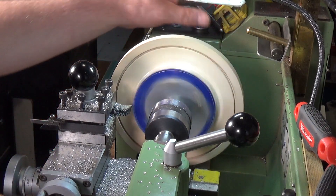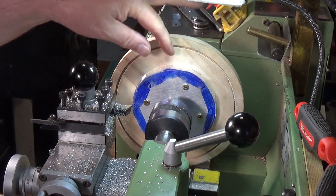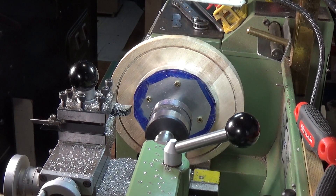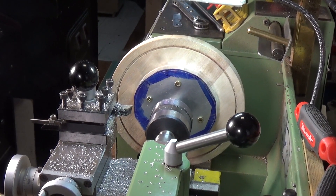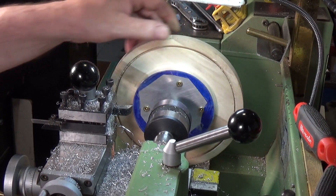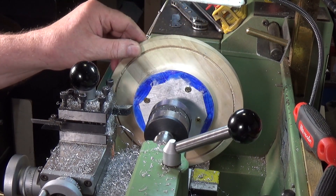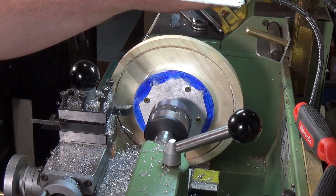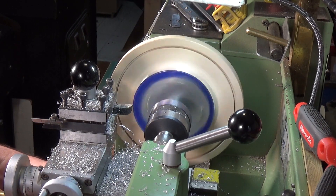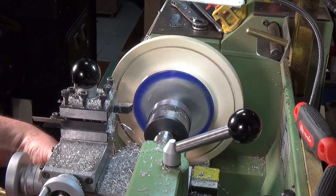While it's still an interrupted cut, it's nowhere near as violent as when we first started, as we're starting to get to a roundish shape. I'll keep persevering and come back when we're nearer to being done. There's just one little flat spot left now — the rest is all round — so probably about half a millimetre, maybe a millimetre left to take off. Slow but steady does it.